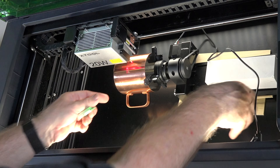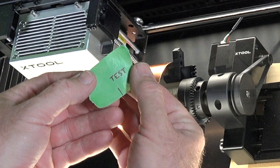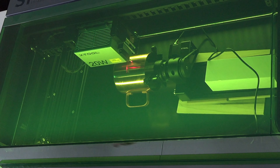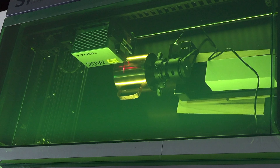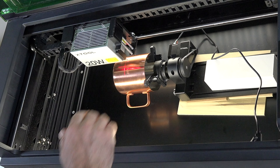The word 'test' engraved properly on the tape. Let's try to engrave the word 'test' on our mug. I kind of figured this would be an issue — with these being shiny mugs the laser is having trouble engraving. Normally on something shiny you need some kind of catalyst like paint or something for the laser to focus on, so in this case it doesn't like this.